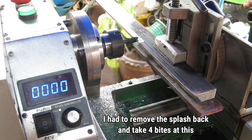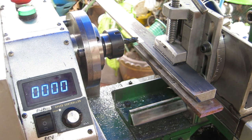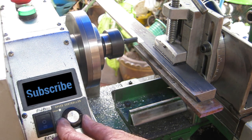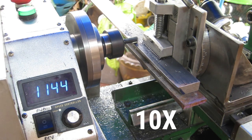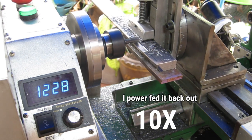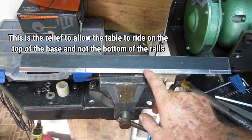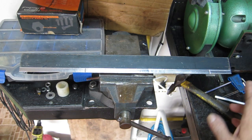I didn't think I was going to get a chance to videotape this - there's a road crew outside my place with manhole covers and are they noisy. They've got the grinder going again but I'll film some of this for you and hopefully they'll piss off and stop making so much noise. Well, it's not perfect but it achieved what I wanted - it looks like it didn't have a completely flat surface because it's cutting uphill there, but it took enough off to do what I needed. Power feeding it back out actually gave it a better finish because it was chewing into it anyway - it'll do the job.